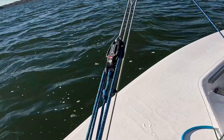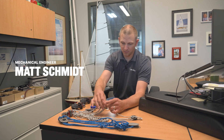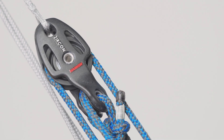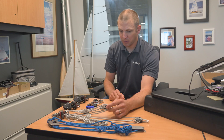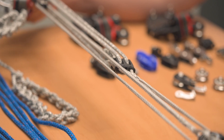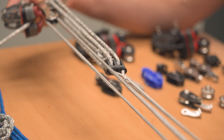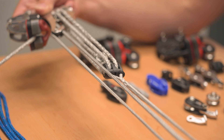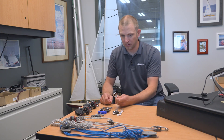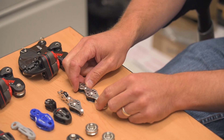The floating center block does a couple of jobs. It's the dead end for the lower portion of the purchase and also the dead end for the cascade on the higher load portion of the system. It's also the block that moves the most, and keeping the alignment of all the lines is important. As the vang gets tensioned or released, that center block is the one moving, and if you look closely you'll see the lines moving at different speeds, causing the block to tip slightly — one side of the sheave gets loaded more than the other. For that reason we chose to move away from the conventional double block and pursue a fiddle option.